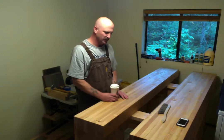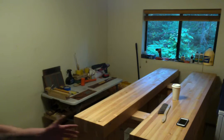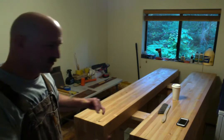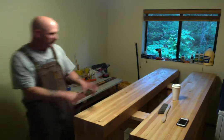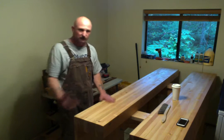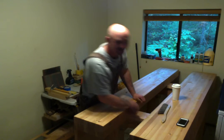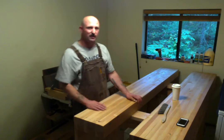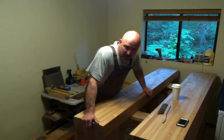When you're dealing with hand tools, this process is not as fast as you might think. It's not as simple as throwing everything up in there, making sure it's all square, and then drilling some pilot holes and running some screws in. When you're dealing with a brace and bit, you can't drill from underneath — that ain't happening with your legs and stretchers all in the way. You've got to use your brain and think of a better way.